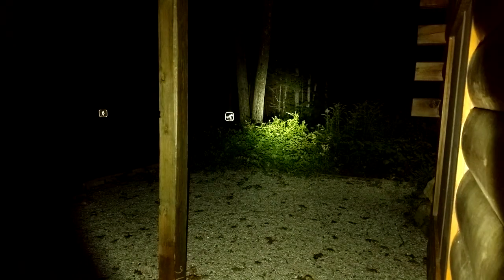Which kind of sucks because this is an E-switch light, which means that there is an electronic switch here, and that is draining the battery constantly. So without the lockout, you are going to have some parasitic drain. But you can lock it out by a simple turn of the back.